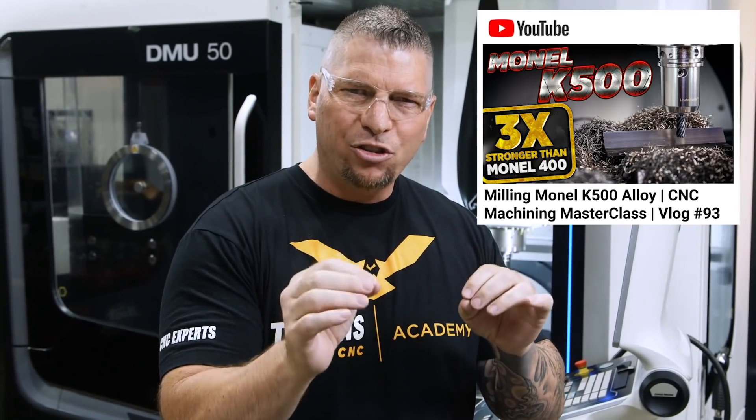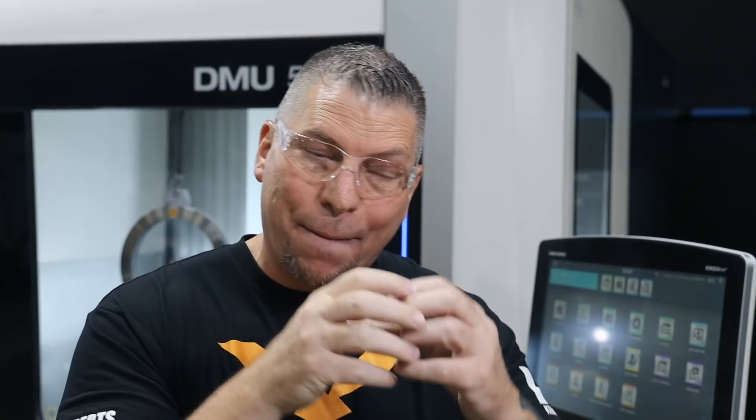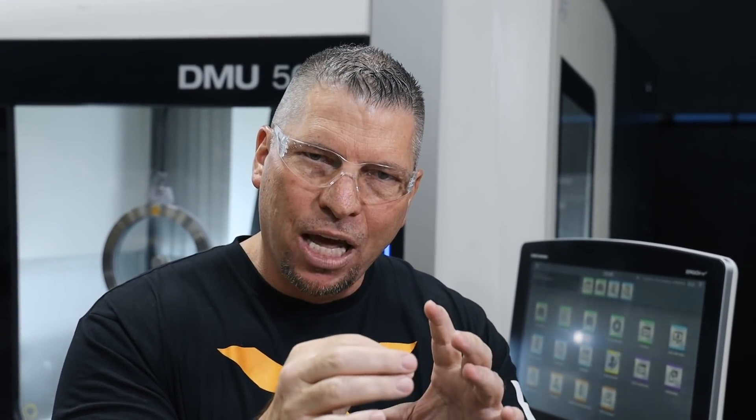So if you look back at our videos, you'll see that we recently released a video on milling Monel 400 and then milling K500, which is 400 but with an additional aging process. They take the 400, melt it, add in aluminum and titanium, and heat it for about a day and a half — 1200 degrees for 16 hours, then down to about a thousand degrees for another eight hours. The aluminum and titanium distributes and crystallizes around the grain structure, which creates the hardness and strength. After the hardening process, K500 has three times the yield strength and two times the tensile strength of the 400.